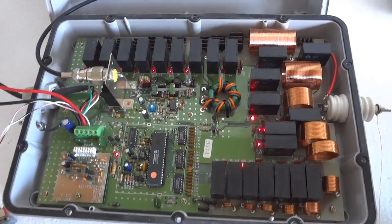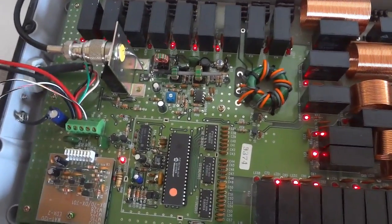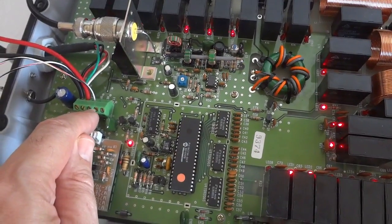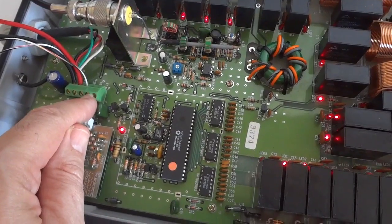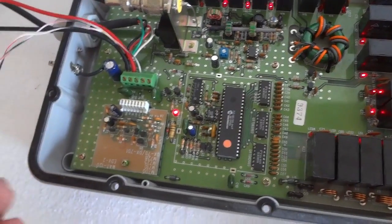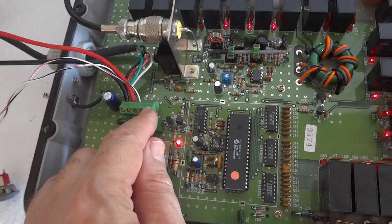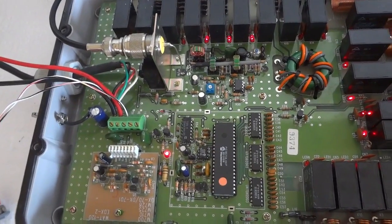You can see the inside of the tuner here — it looks like new. I hooked it up to 12 volts and took off the original cable from the terminal block. The terminal has ground, plus 12 volts, tune start, and key. Start means the tune cycle will start once you pull it to ground, which I do with this simple make switch that I hooked up.